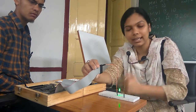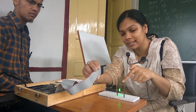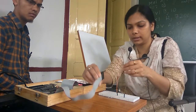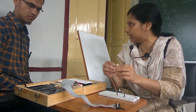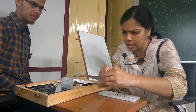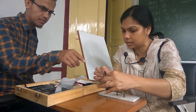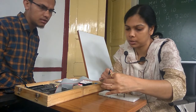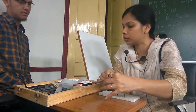See, the LED is glowing, right? So the LED will glow when we are sending 0 to the cathode. Okay, so now I have to send this 0 through the port. Through my program now I wanted to do it, right? So for that you have to connect it to port PA0. PB0. This, so is this B? This is A, right? Yeah, pin number 30. Which one? From here. So this is 1, 3, 5, 7, 9, 11, 13. Yes. Okay. So now can you run the code?